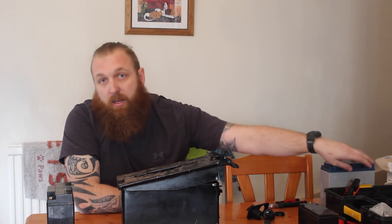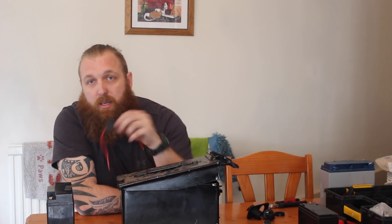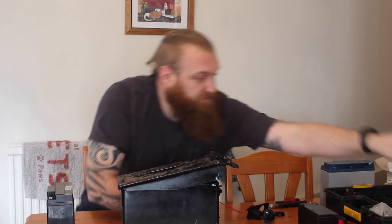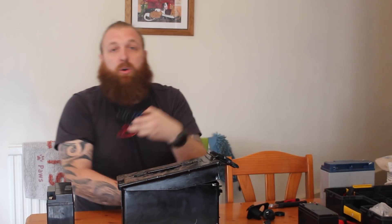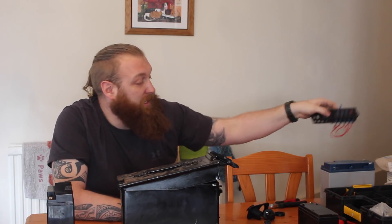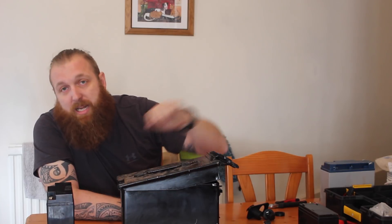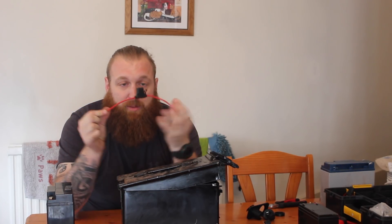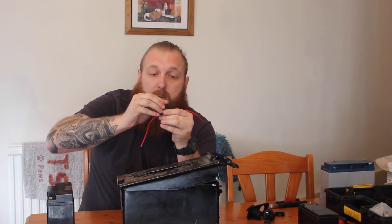The other thing that is essential, I would say, is a fuse. There's multiple different ways of doing it. You can go for a dedicated fuse board, or you can get fused boxes with switches already attached. I'm just going to do a little inline fuse - you choose what fuse you want, bob it in there and attach it inline. If there's any issues, that pops before everything sets on fire - that is important.